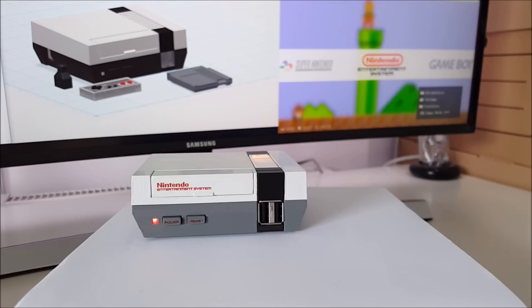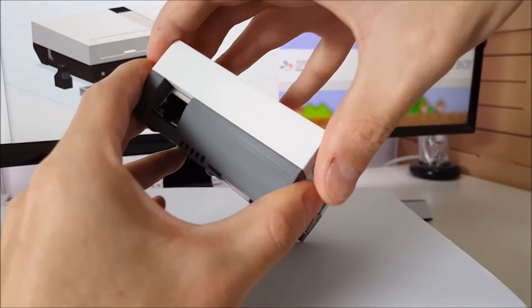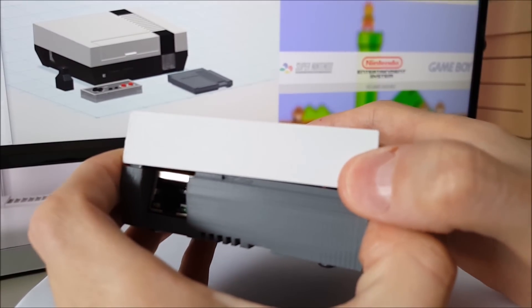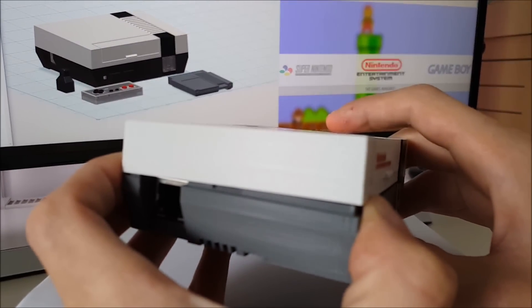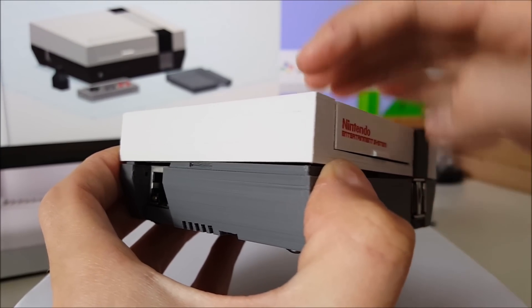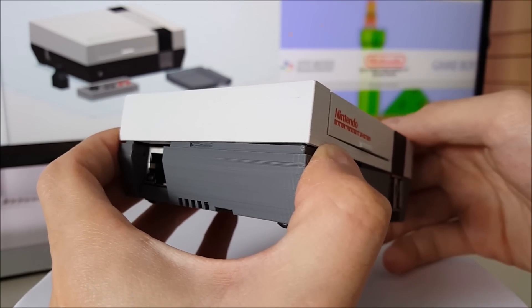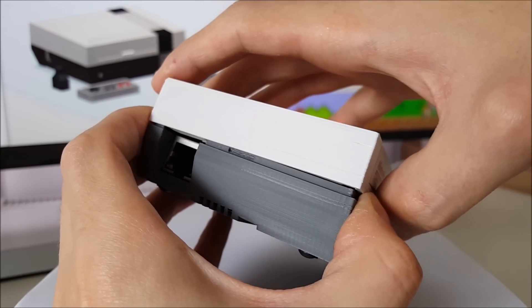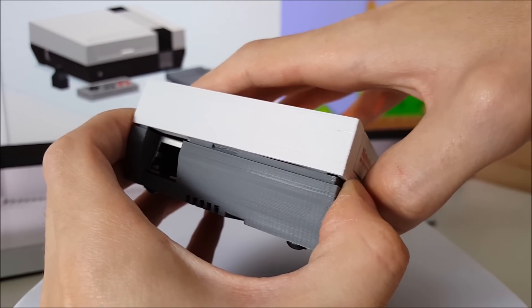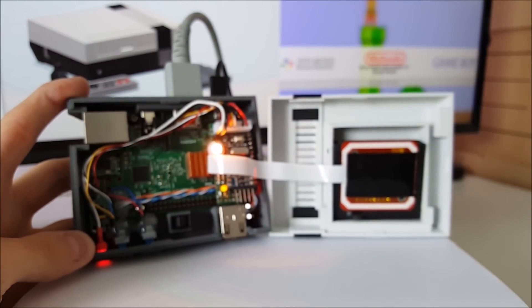What I've done with my build is make the cartridge slot functional. The inside of the case just unclips. There's a little indentation - one on each of the sides and a tab in the top - and it just allows the case to click together without screws. I learned how to make these in a video by Noah from Adafruit, and it's a really handy way to put together 3D printed stuff.